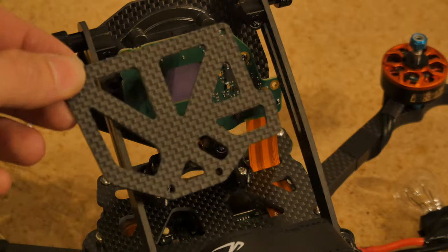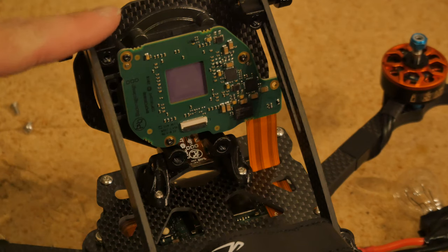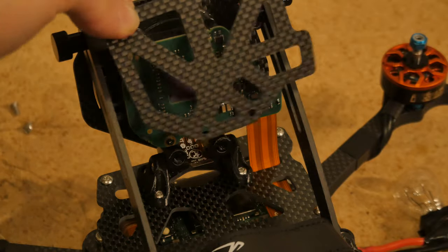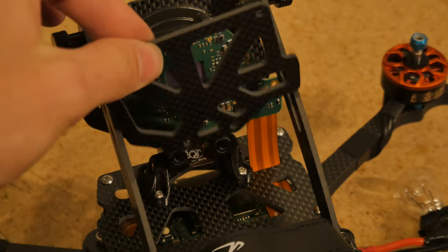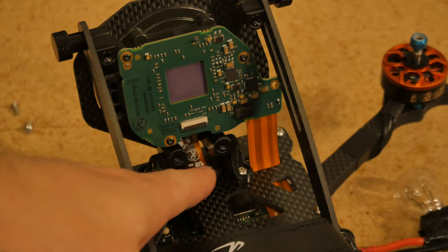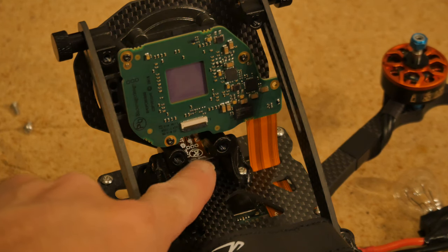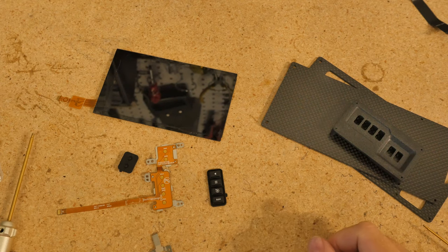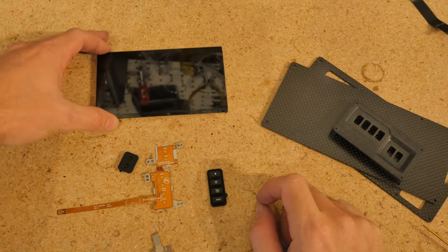Sam from the future here. Go ahead and remove this back plate until we finish the sensor shim calibration process. The reason why is because this plate is made out of carbon fiber. When you're leaving the lens communication ribbon loose like that, it can actually make contact with the carbon fiber, which could potentially cause a short. So just take this and remove it and set it aside until everything is ready to go and the ribbon is installed into its appropriate connector.